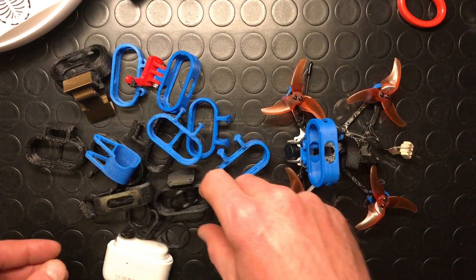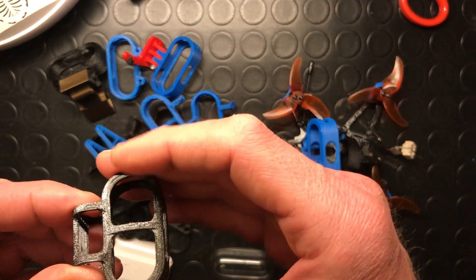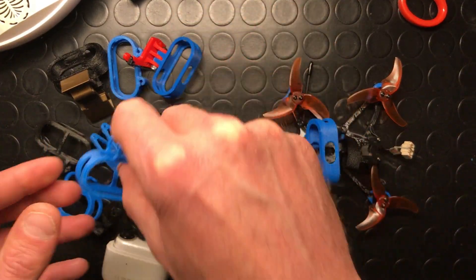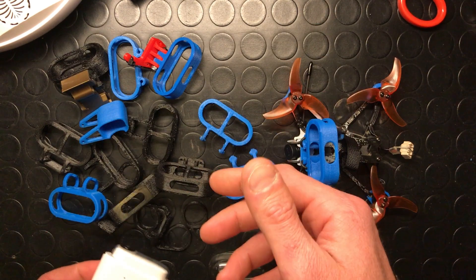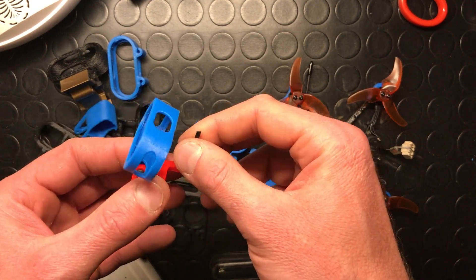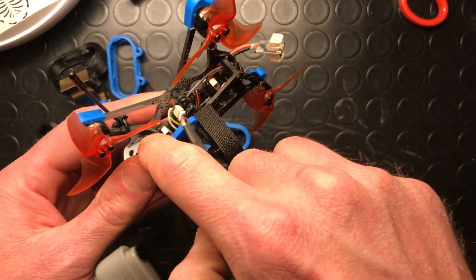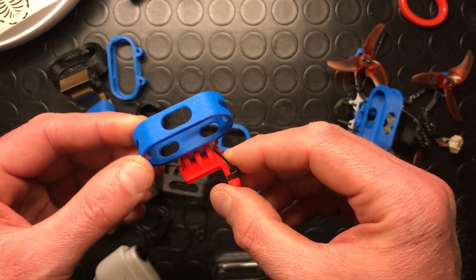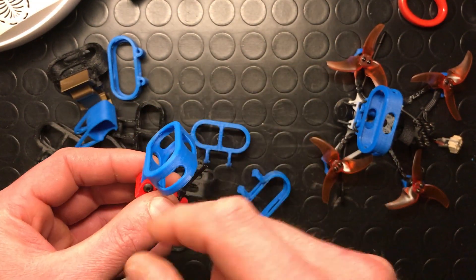The solution I found after making a lot of tests — as you can see here — uses 3D printed parts made from TPU. They are soft and very elastic. I made a lot of them to try to get a solution to this big problem with this camera. The first test I did to understand whether there was really a jello effect was a mount — a direct mount on the frame, printed in red PLA. This is an attachment similar to a GoPro attachment, with an M3 screw — a direct fit.